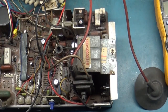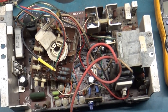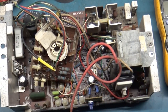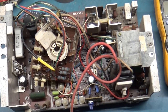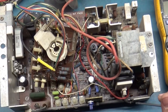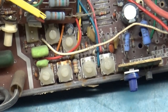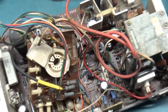Okay, so hang on one moment. All right, so I got this other 4900 here out of a Commando machine that has some slight vertical collapse. Everything on this is original. I was the first person to ever remove this from the monitor. Original caps, everything. So this has a slight collapse across the top, so it needs caps, but it's been sitting over here off camera for a while for me to get to it. But you can see here, R317 is quite different on this one. It's right here. So I'm interested to read this and see what it shows.